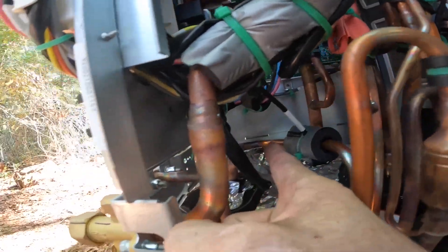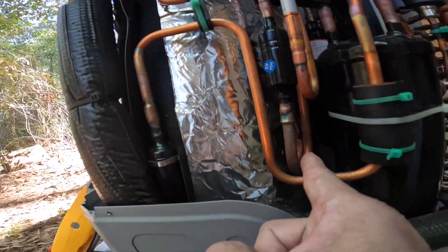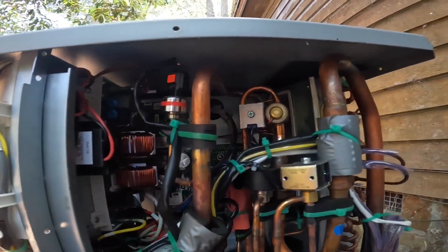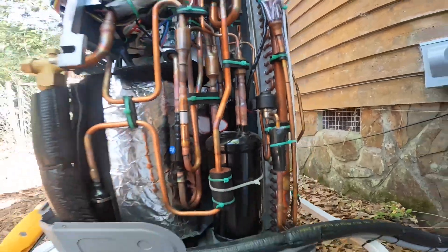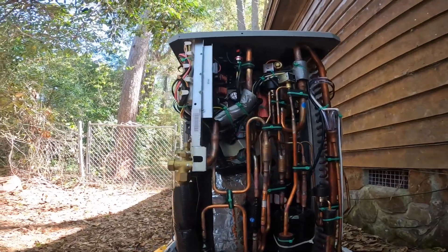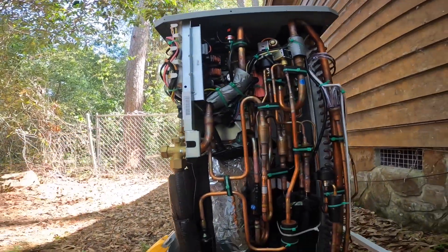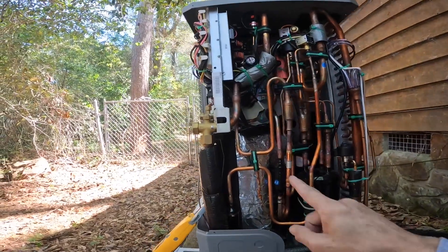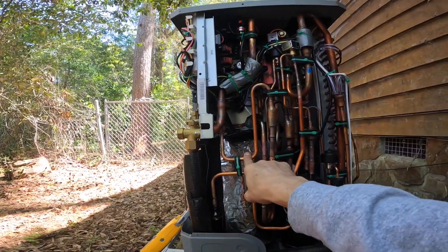This is my hot gas here — I follow it down and it does not have anything coming right off the hot gas, so it's got to come out of here. A medium temperature — not hot gas — going back into suction would be on my liquid line.